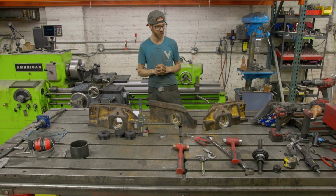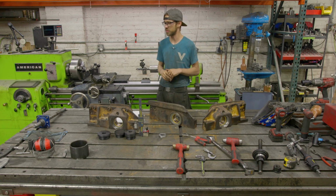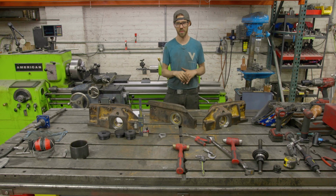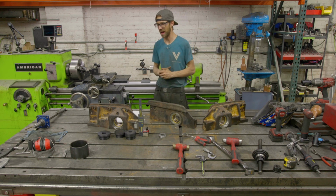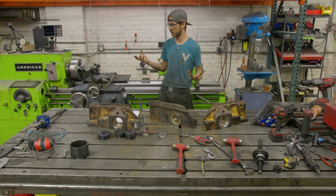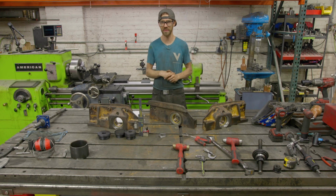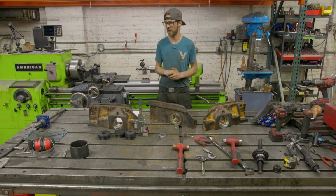So the bar. I used a mild steel bar that I used when line boring the arbor press, and terrible idea. Obviously that seems pretty obvious in hindsight. All the boring bars out there for line boring are chromed, but when you look around, chrome is not readily available, meaning it's not laying around, right? If you're a hydraulic shop, it probably is.